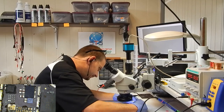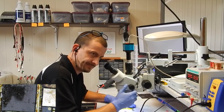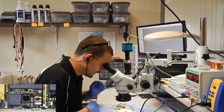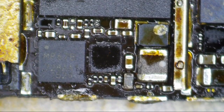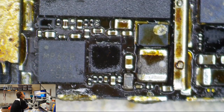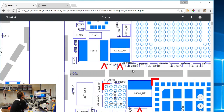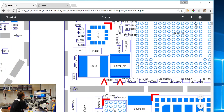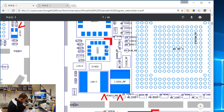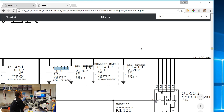This is going to be on the other side of the board. My load there is 5 amps, by the way — so we have got a crazy dead short to ground on VCC main. I wonder if it could be that obviously damaged cap down there at the bottom. You can see it right there in the middle of my screen. Going over here — and just to the bottom left, C1411, also on VCC main.